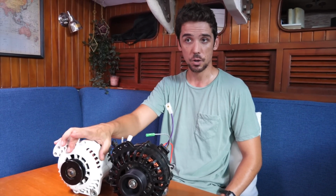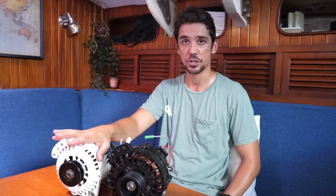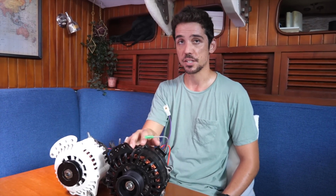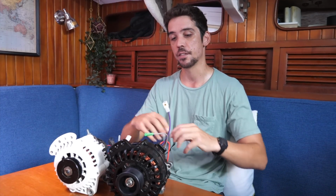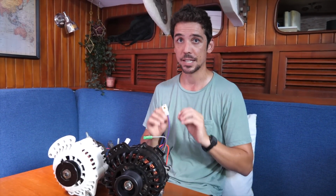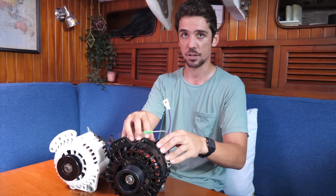I've seen, and the controller tells you how hot they run, I've seen this thing running at 120 degrees before, which is absurd. You can cook an egg on it. So I'm hoping that this one runs, because it's so much larger, it doesn't need to run at full capacity. And thus, and because of the anodized shell and the much larger ventilation, I'm hoping it runs a lot cooler and a lot more efficient, because the lithiums that this will have to contend with are going to accept as much as it can give them for as long as they need it.